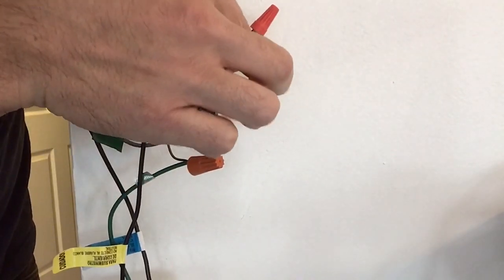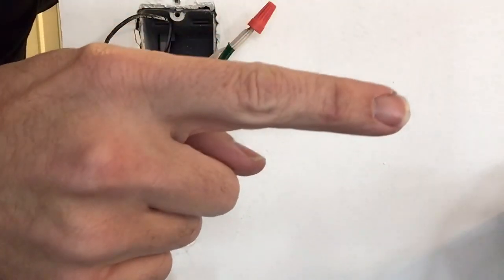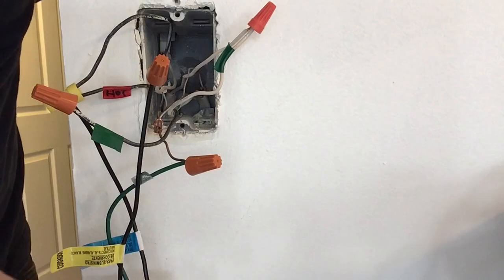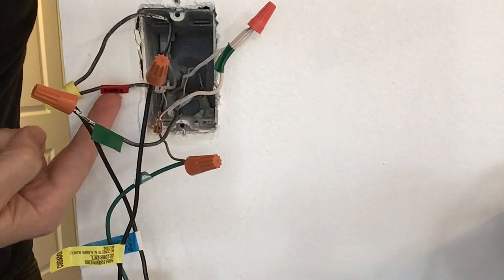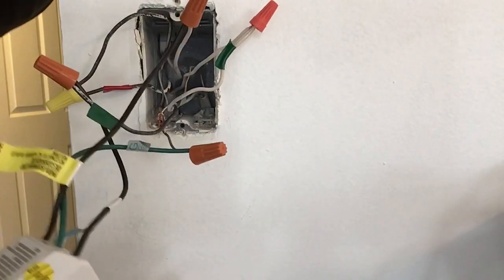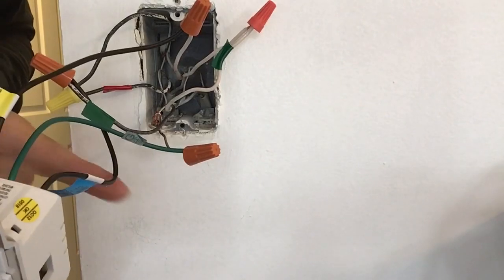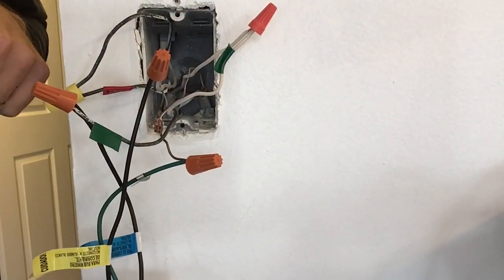Here's finally what I managed to do. I determined that two wires labeled with green tape go straight down to the bottom switch. In the middle switch, there are two additional wires — one of which is hot and not supposed to attach to anything, which was confusing. Here's how it's wired: power comes up the hot red line, then goes up to the ceiling fan, comes back down the white line, goes into the black line into the switch, passes across the remote control, and comes out the green-black line heading downstairs.